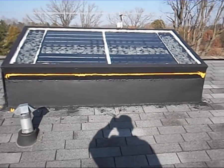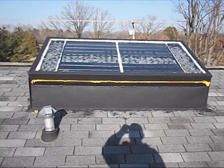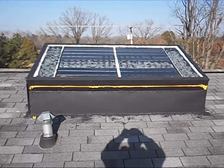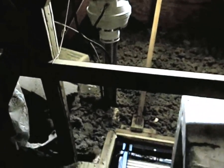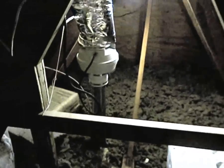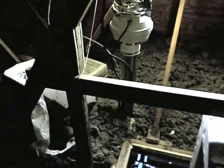That clearly shows you the panel. Now we're up in the attic, and here is the cold air duct coming up from the back closet — all the way back against the back wall. That four-inch duct goes all the way down to the floor, with a four by ten register on the end.